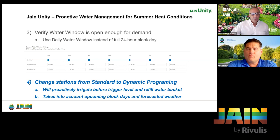We've got a question: should you do this just in the summer or year-round? I would do it year-round. Obviously summertime is the most demand for water — we're going to be watering more often and longer run times. But changing water windows even during the wintertime gives you more flexibility than having just one water window for every day of the week. If you have different events or different stuff going on at certain times, you can adjust water windows to work around any type of events for your client or HOA.